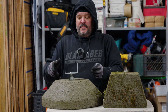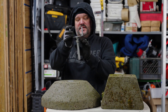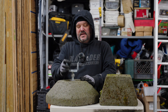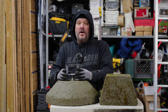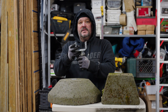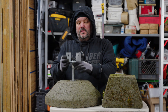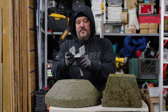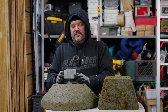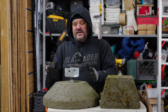They also have a slightly oversized hole compared to the standard footing block. I don't make them, I just use them. This saddle is adjustable — you can see the nut right here; you can spin it up and down to raise or lower it to get your elevation height before you finish building your deck. You can also epoxy these in so you don't get any uplift if that's a concern in your area due to high winds.